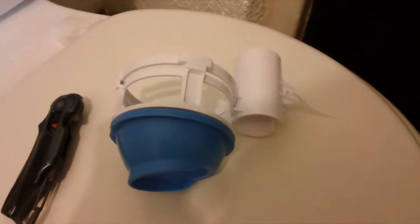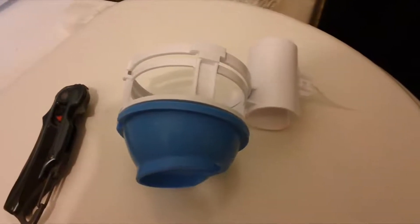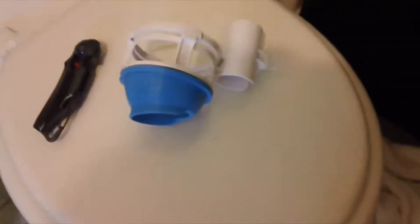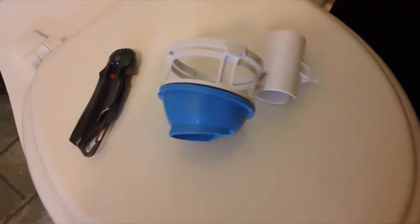I was right. Since this is a high-flow or low-flow, more water-efficient tank, what I'm running into is this knob right back here that latches the little insert — which replaces the flapper — onto the tube. Those notches, since there's such a small gap back there on my tank fill tube, I can't get it on there. So what I'm about to do is shave a little bit off the back of that knob to see if I can make it fit.